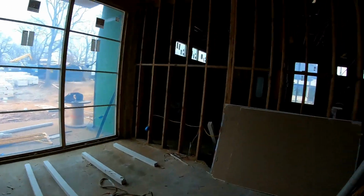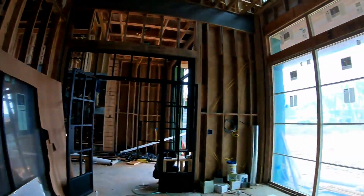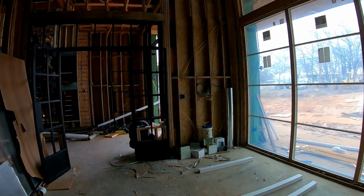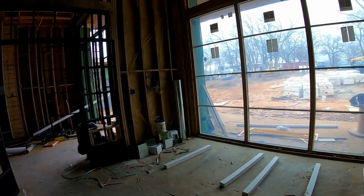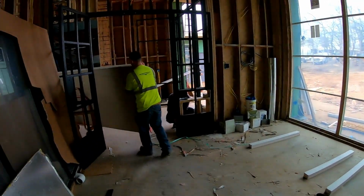So overall, that shows you everything that it takes to wire a large-scale home automation system. A lot of planning and prep that goes into something like this. 17, 18 zones of distributed video, 24, 25 zones of audio, multiple in-wall, in-ceiling subwoofers, controlled panelized lighting.